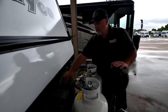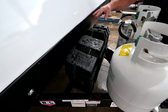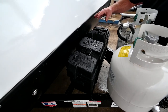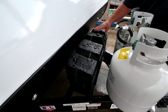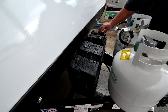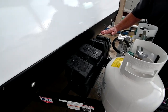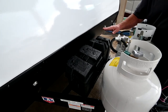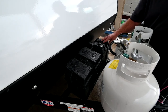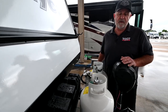You've got two deep cycle marine batteries here. They have caps on them like batteries from the old days, so you can take the caps off and look in there to see the acid level. In the summer is the main time you'd want to do that. If liquid is covering the lead plates, you're good. If it's even with them or below, you're going to want to add distilled water. Just cover them up — you don't need to fill it to the top — and that will keep your batteries in good shape.